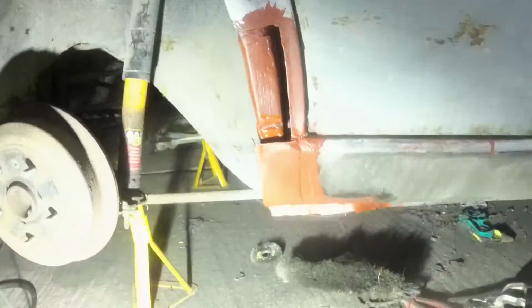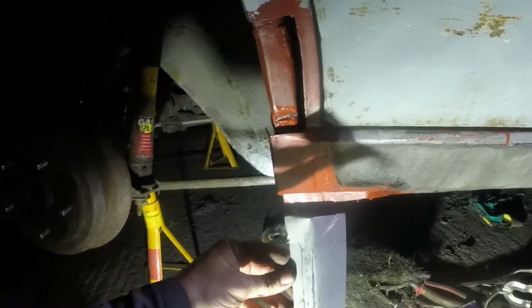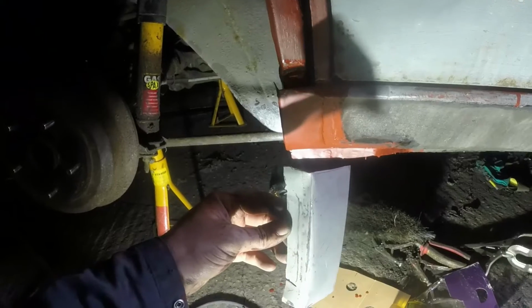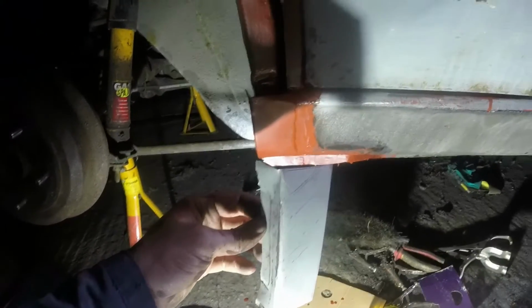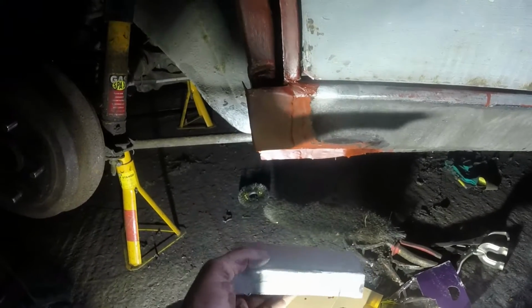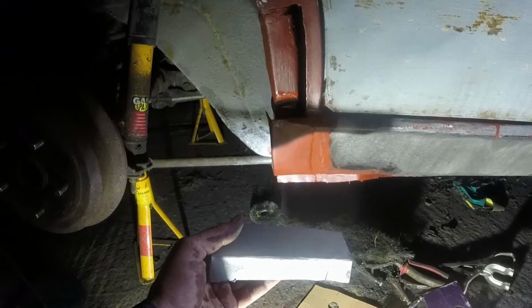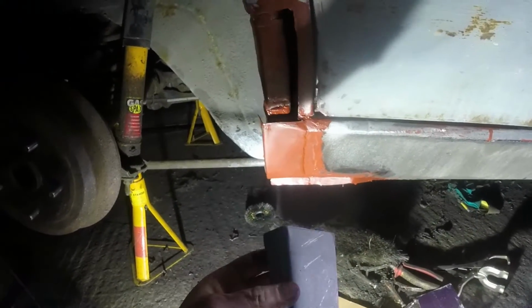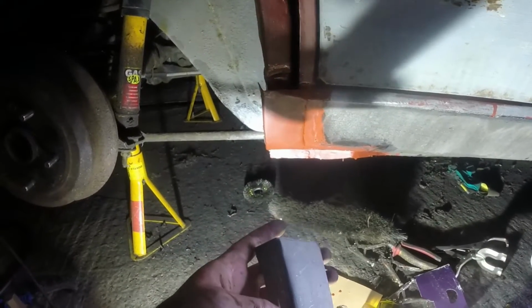Been over in the back cave, hammering on metal. This started out as a piece of flat, obviously. I put a crease in it, like a fold, but when I did it, I used washers again, clamped between the underside and the folding jaw, so that as it folded, it folded tight at the ends, but not in the middle, so that crease isn't as sharp.